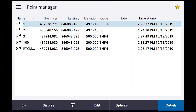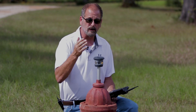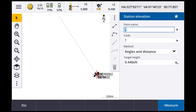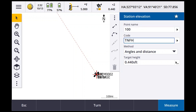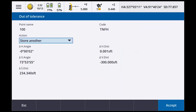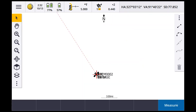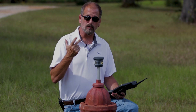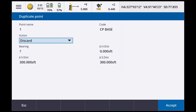If we go look at our Point Manager, you'll see that the top nut of the fire hydrant was 500, but all our other points are in the 400 range. So let's go to Station Elevation, say number 100 Enter — 'top nut 500, measure, out of tolerance.' We've got options. Say Store Another because we already shot this a moment ago. If we look at Results, the elevation back at our gun — point number one — is now 197.71 instead of 500. Say Store.